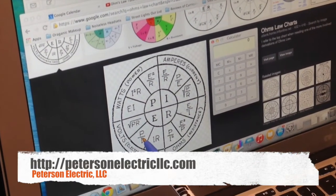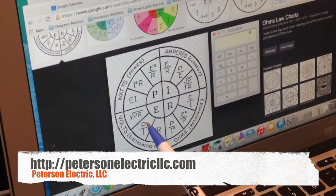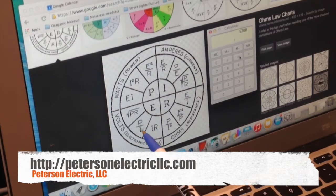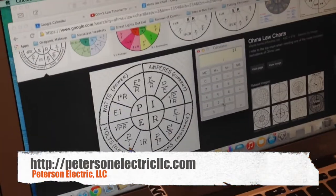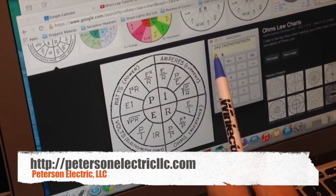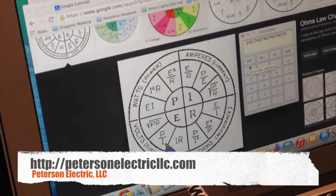Then, if we want to look at it this way, 5,200 watts, divide that by a normal operating amperage that we already proved at 21.6 amps, is 240 volts. Yes, that's right on. So that's normal voltage.